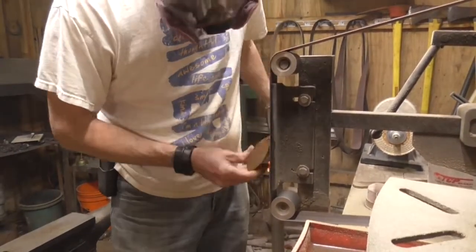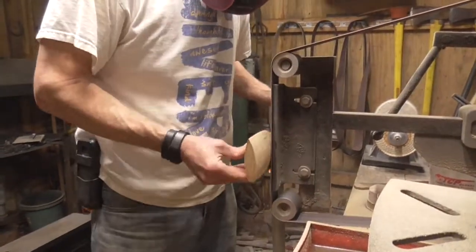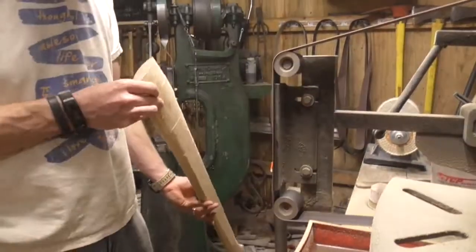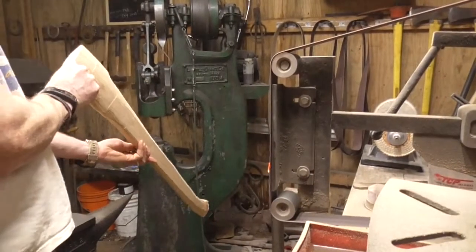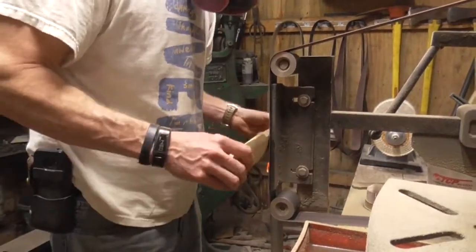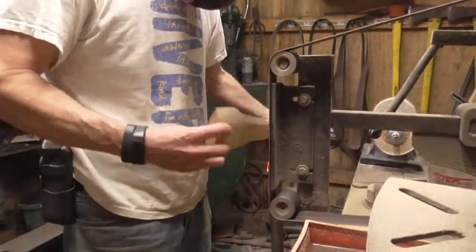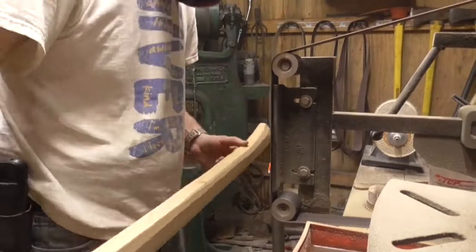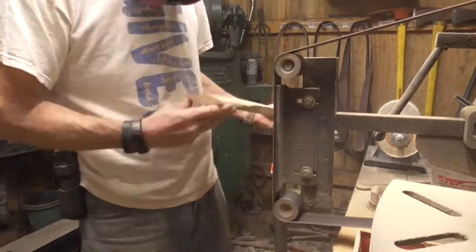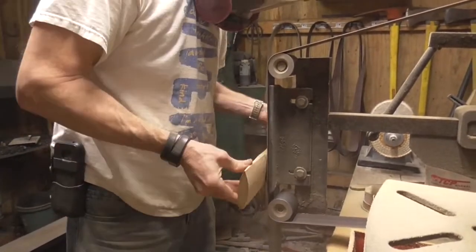Now we're switching over to doing the oval. This axe head had probably the longest and thinnest through-piece of anything I've played with so far — kind of interesting to try to profile to that. Basically I'm just trying to work down to the profile I've drawn using a pencil from the inside of the axe head itself, periodically working on that dome on one side and the offset on the other. When I get close enough we'll start to see me putting the axe head on — there's that domed side I'm trying to shave a lot of material off.